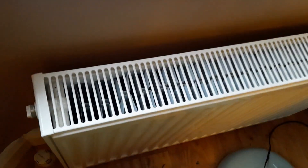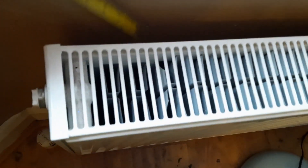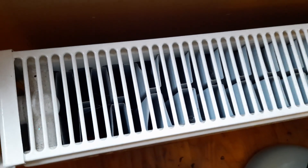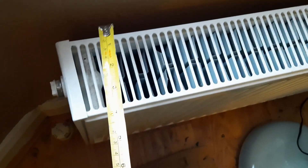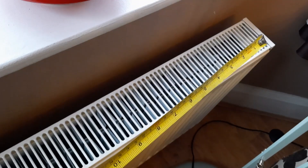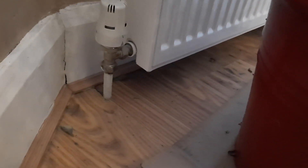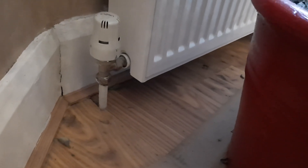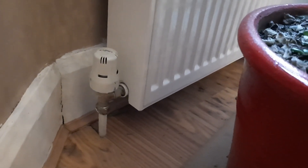While you're also in the room, we need to have a look at the radiators. You can see this is what we call a double panel double convector radiator. If you look carefully, there's one skin of radiator at the front, a second one on the back, and inside you can see little fins called convectors. I'm interested in the depth, length, and height of the radiator. Also have a quick look at the pipes — you can see the pipe coming into the radiator here. It's worth taking a photo; in this case it's 15 millimeter pipework. You have to do that for each room.